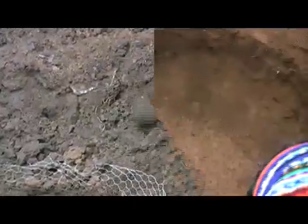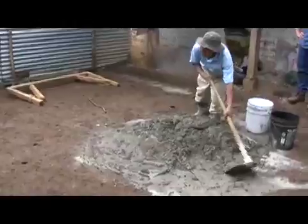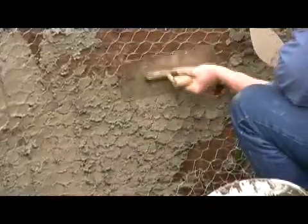The in-ground tank — we started by digging a hole, and then we proceeded to cover the inside of that hole with chicken wire. Then layer by layer we could apply a very fine cement mortar mix, let one layer harden, apply another layer, and build that out until we get a total wall thickness of approximately three to four inches.